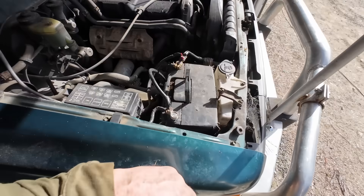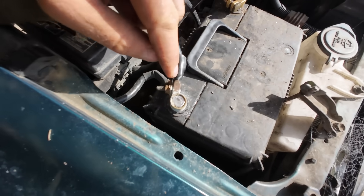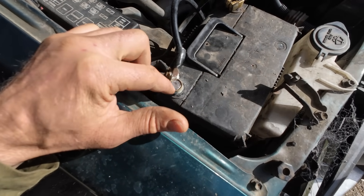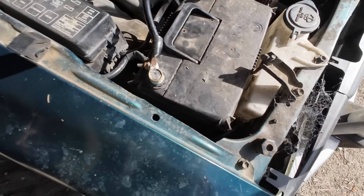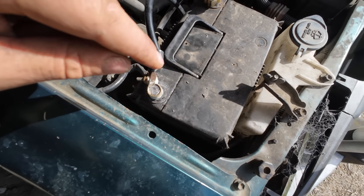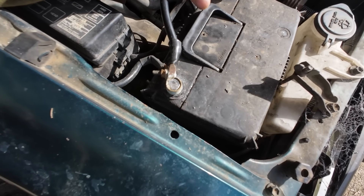Oh easy, perfect! Well that started without any problems so I think it's a success. Not bad for a first try. There's definitely a bit of a technique to doing it — the first time I tried it just didn't melt all the way through. So I think it's best to cut the actual pole off and start from the base, and sort of poke the rod around as you go to melt it and build your way up, and that doesn't leave any voids.